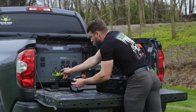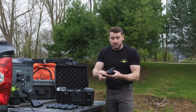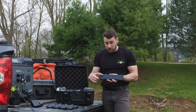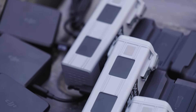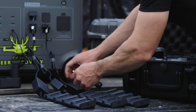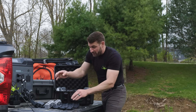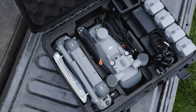You need to have three chargers to fly indefinitely — that way you can fly all day long, all night long. The battery hub has four slots for flight batteries. It only charges one battery at a time, so if you have four batteries on there it charges them sequentially. You need three chargers so you can simultaneously be charging three batteries at once at the same speed. If you'd be doing deer recoveries or pet recoveries, you probably wouldn't want to pack all that stuff into your case every time moving from one location to the next. I would probably have it set up inside my truck with a battery generator so I don't have to do this when I get to my location — but I wanted to show you that it will easily fit into your carry case.